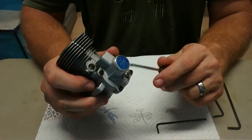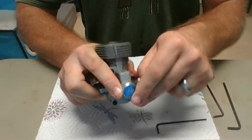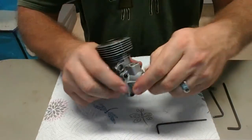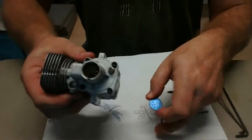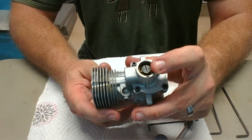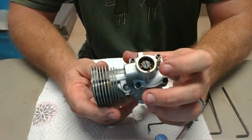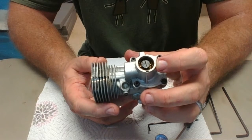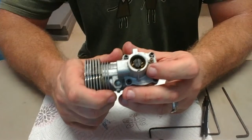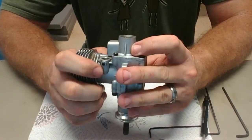This back cover is just a pop-on with an o-ring that holds tension on it. I'm going to pop that off. You can see there's a screw here that can be tricky — it's a left-hand thread screw, and to get some of the internal components out you have to unscrew it. That can be tough because it's usually really tight, and the steel it's made of is brittle. If you forget it's a left-hand screw and crank it the wrong way and break it, you're in for a really bad day.